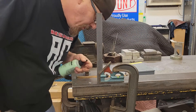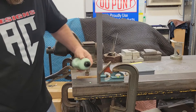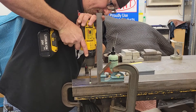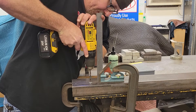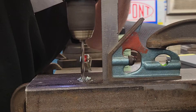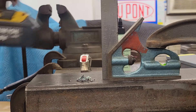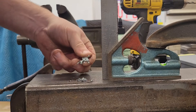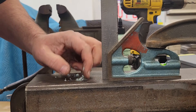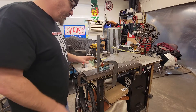We've got to dip it — put a little of the Anchor Lube on here, looks like toothpaste to me. Cool thing is the stuff doesn't smoke or stink. That went pretty quick through the 3/16ths. I want to show you guys how cool this stuff is — these shavings and chips don't leave an oily residue like some other cutting fluids do. You can just wipe it off and this stuff's not even warm. I will say that little C-clamp and square contraption did pretty daggone good.